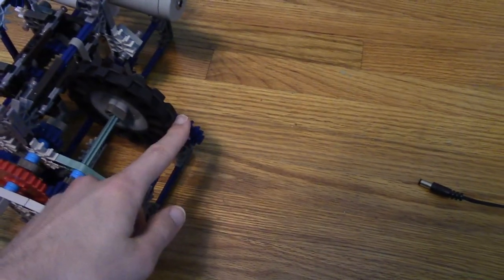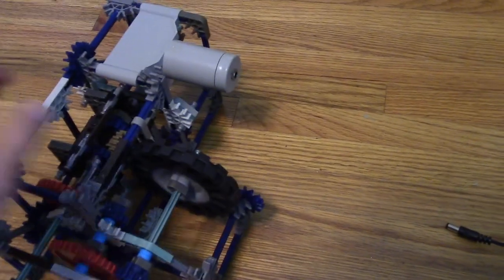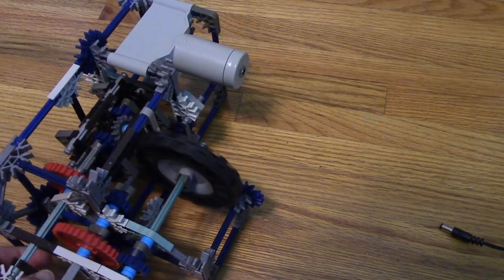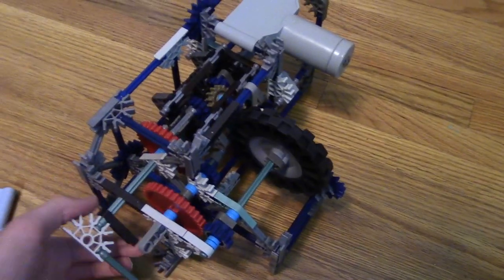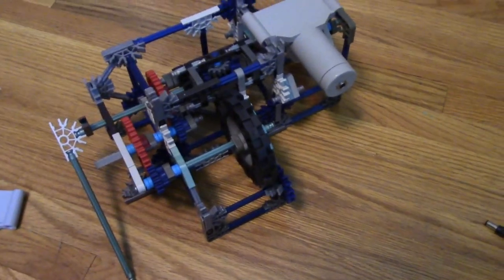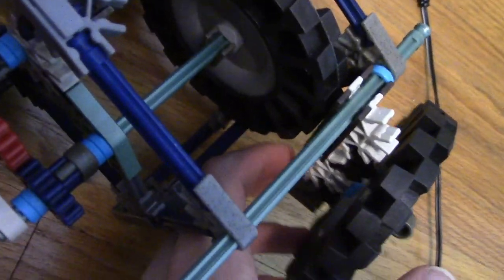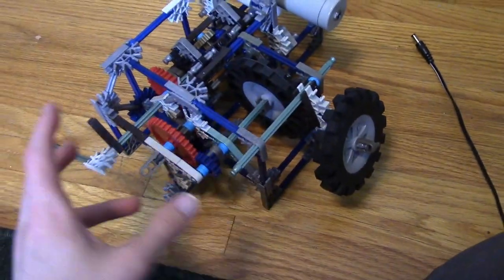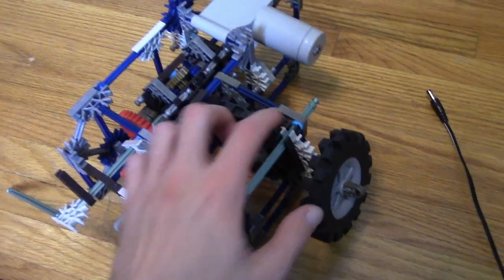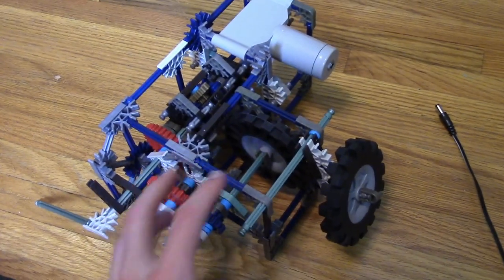What I'm going to do now is make a brake system similar to what I had before, to go onto the flywheel itself. The goal here will be not so much making it go slower, but just to stop it and allow it to do the opposite of what it does when it spins up. So instead of stopping it immediately and getting a jerky output, it will stop it gradually. And you'll see more of that when I actually get a video of it. Here it is with a simple brake installed for the flywheel — there's where it makes contact. Now you might be wondering: if a brake didn't work on those other versions, then why am I doing a brake here? Well, it's a lot different when the brake is used with a flywheel, because the goal isn't to change the speed — the goal is just to stop it smoothly.